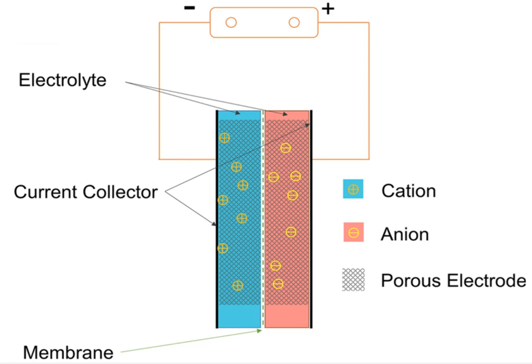Topic: Lifetime. Since supercapacitors do not rely on chemical changes in the electrodes, except for those with polymer electrodes, lifetimes depend mostly on the rate of evaporation of the liquid electrolyte. This evaporation in general is a function of temperature, current load, current cycle frequency and voltage.